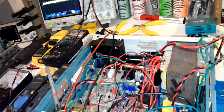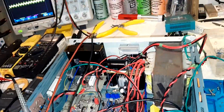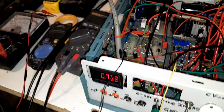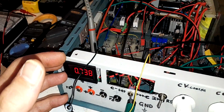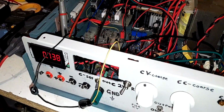So, when I first saw this, silly me, I actually just thought that the panel meter was just leaking some full wave rectified, like 100 hertz DC ripple, coming in off of the 12 volt rail that I am powering it off of. And you know, that was coming back out and into my circuit. I didn't actually consider that the meter itself was producing any kind of noise. I just thought it was leaking noise through itself, if that makes sense. Out of one wire, in one wire and out the other, so to speak.